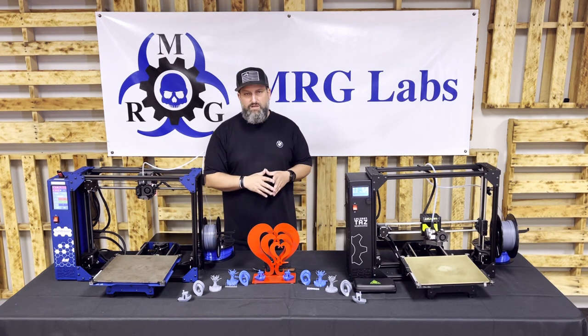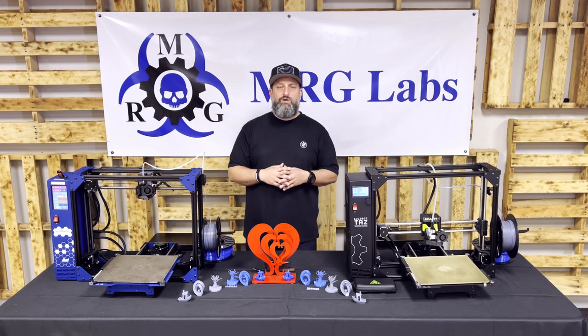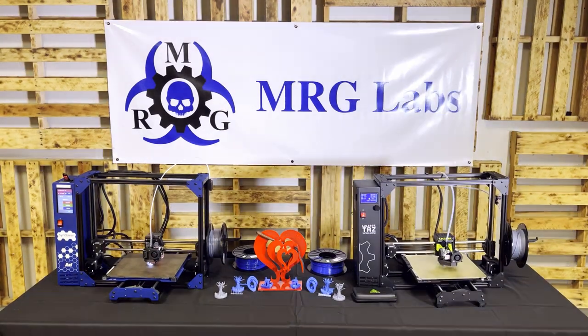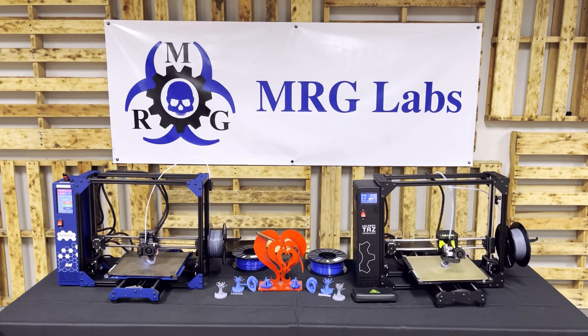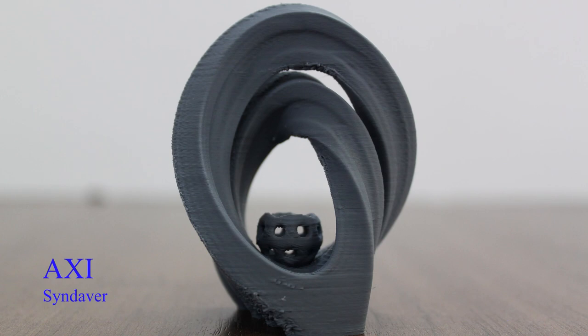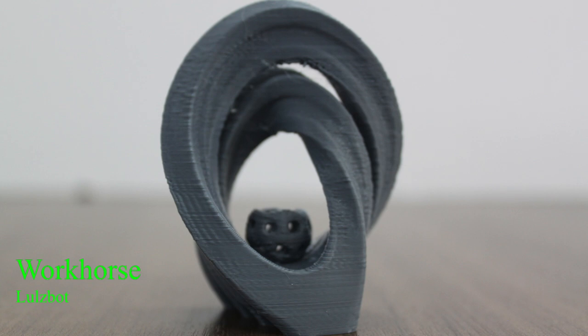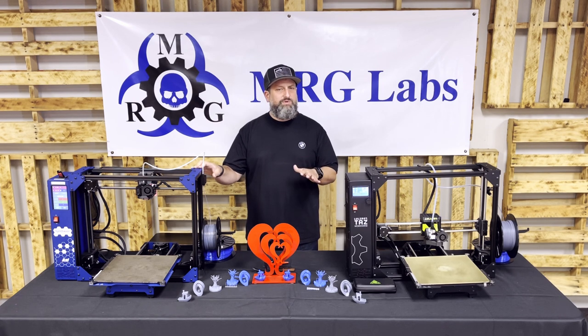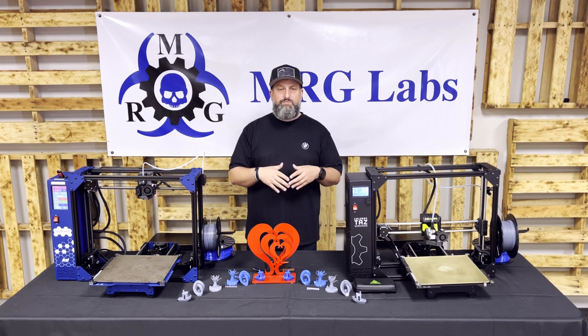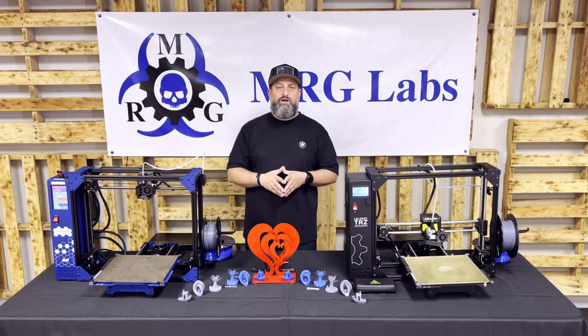Next, onto the Mobius Strip. In an attempt to see what kind of accuracy each printer could achieve with more complex geometries and overhangs, I ran these at an increased speed but otherwise standard profiles from each printer. Both printers completed this print, but you can see how the resolution and clarity of the Axie print is a little bit higher quality throughout. The Workhorse took about an hour and 18 minutes to complete the print, and the Axie took approximately an hour and 38 minutes — as expected, about 20% slower due to the 20% smaller nozzle. Often when you get to this point with overhangs and have dialed in all other features, it comes down to the properties of the material and dialing in temps, cooling, and speeds to obtain the goals you set for overhangs.